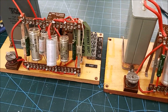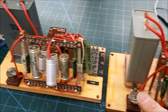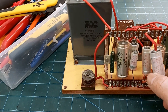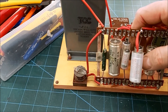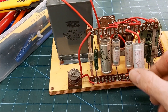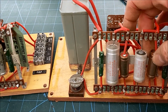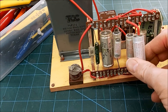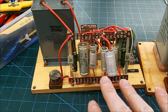Both crossovers are out again and there are some slight differences between them, just in the capacitors. On the one we previously took apart, we had a 1, a 1, and a 0.5 - so 2.5 total - on the woofer circuit. But on this one we've got a 1 and a 0.5, so 1.5. This looks to me like it's been added on, given that this speaker was the one that was a bit all over the shop.